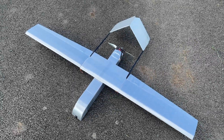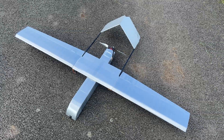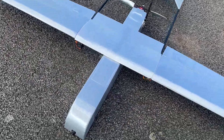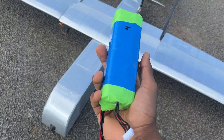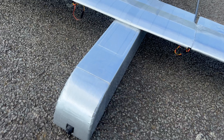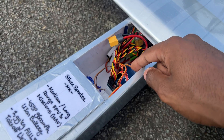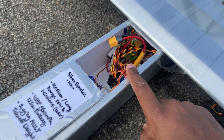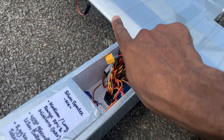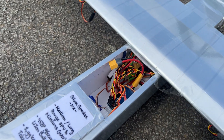I'm going to first tell about my aircraft, the Spectre autonomous UAV. It's 1.7 meters in wingspan and flies a 4S2P lithium-ion flight battery for approximately one to one and a half hours. The top hatch provides access to the flight controller and all the wires, and also allows the receiver antennas to be placed outside the fuselage in a V configuration for best reception and diversity, and folded back inside for storage.